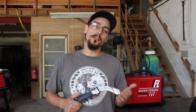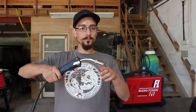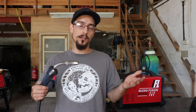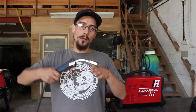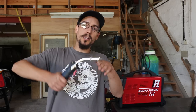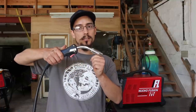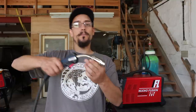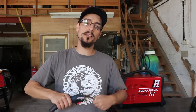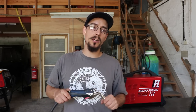So you can believe what you want to believe, but the main benefit for me of putting a ripple pattern into the weld, other than it looks nice, is that I'm able to do a long run and keep it very consistent, because I can get a bit of a rhythm going and roll it all the way along. Whereas if I'm trying to do a really long straight push or pull, I seem to lose my speed a little bit and I'll end up with a bit of an inconsistent weld. But you do all different techniques for different applications.